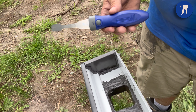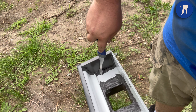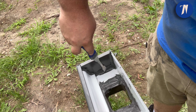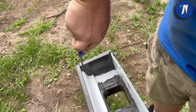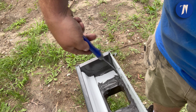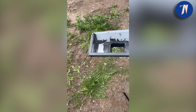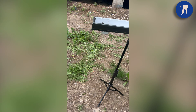This is where the spatula comes in handy. You just come in and really push it into those grooves. It saves you from getting your fingers all covered in it, and sometimes it's hard to get into areas like this with your fingers. Now you've got a nice watertight seal on the gutter so it'll never leak.